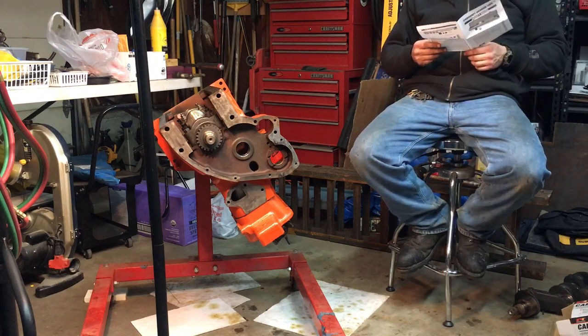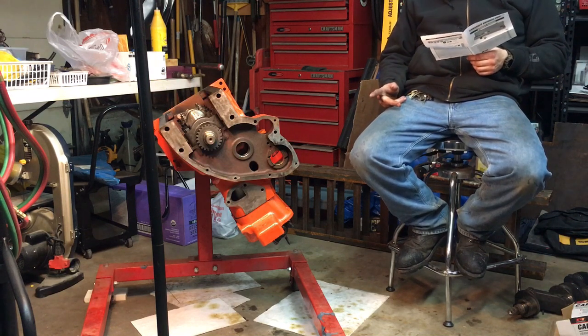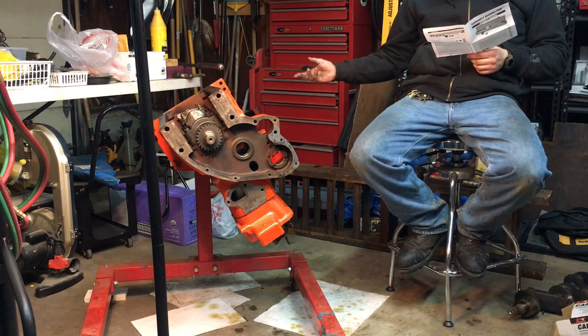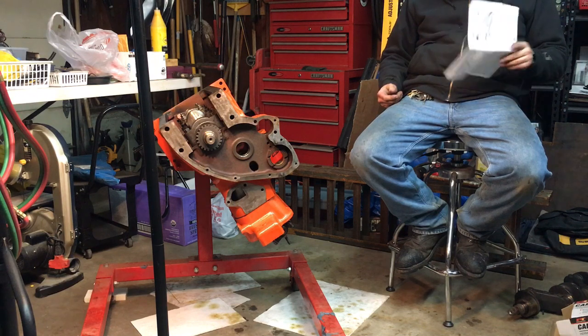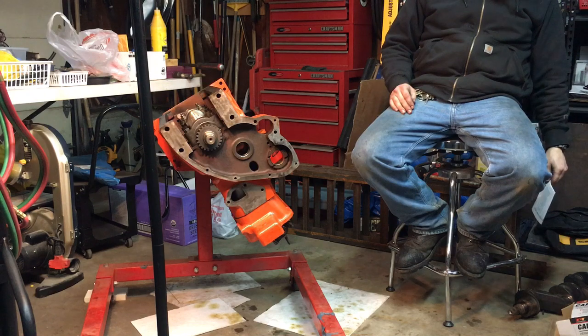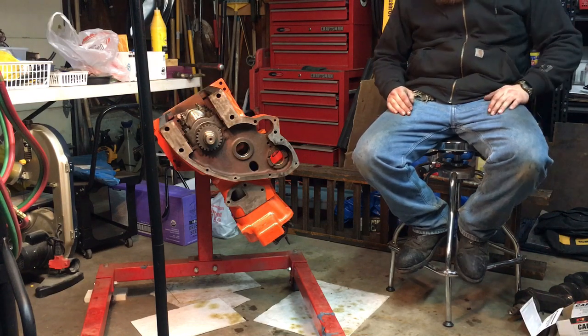So, looks like we're going to order some stuff on Amazon tonight. Use the nylon centering cone in the first bearing housing at the rear of the block, and then drive the bearing in. All right. Well, we learned. That was about $80, and I'm really disappointed.